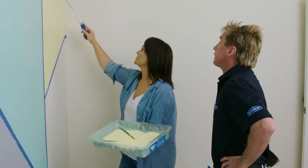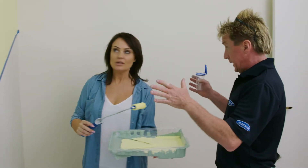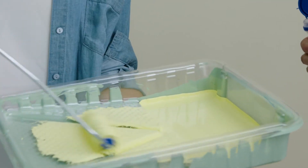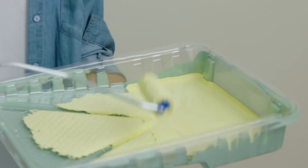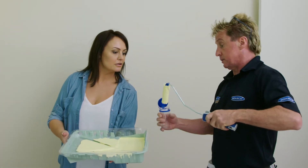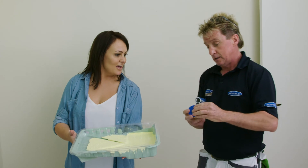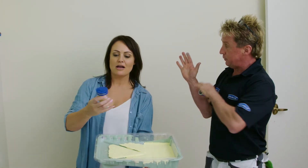How's that one? Almost done. How good does it look? It looks sensational. Okay, before we do our last color, here's a great tip: put a bit of paint on that roller as if you're going to use it, because we're keeping it moist. Not going to wash it out because we're going to use it for the next coat. In the storage container — press down, out it comes. Store that, no paint anywhere, won't dry out. Love it.